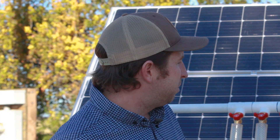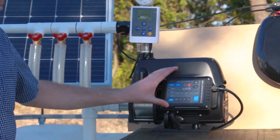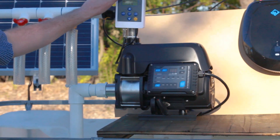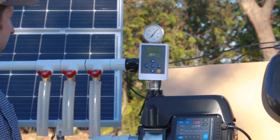This is called our tankless pressure pump system and a lot of people ask what does 'tankless' mean? It means you no longer need a pressure tank — often called a bladder tank. That's going to save you hundreds of dollars from not having to buy and maintain one. The way we achieve that is we built in the pressure transducer and the motor controller so the motor can quickly react to loads in order to maintain steady pressure without needing an extra large booster tank.